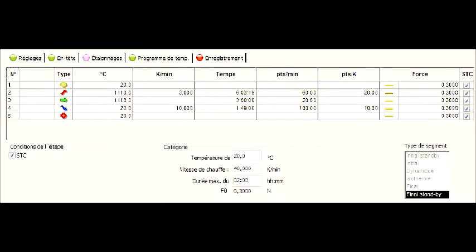For this program, you start the session at ambient temperature, then increase it to 1110 degrees at 3 degrees per minute to densify the pellet. The software will estimate it at 6 hours, then it will stay at this temperature until consolidation of the ceramic, and then decrease temperature in order to consolidate it and stop at ambient temperature.